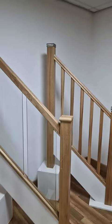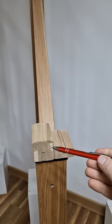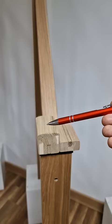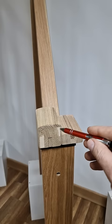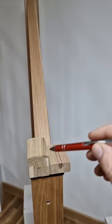This is how it looks. The handrail itself is engineered oak. Why is it engineered? There are quite a lot of questions about whether it's solid. If you have one piece of solid oak, especially a long piece, it's very likely to warp, twist, or bow. The engineered process stops that bowing or twisting. The manufacturers use all the pieces in the manufacturing process — small pieces, short pieces — all glued back together, with a nice layer of prime oak on the outside skin. That engineered process keeps the handrail nice and straight.